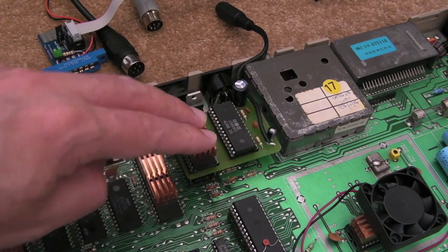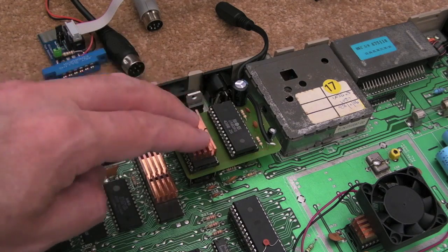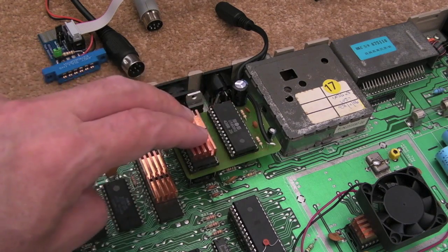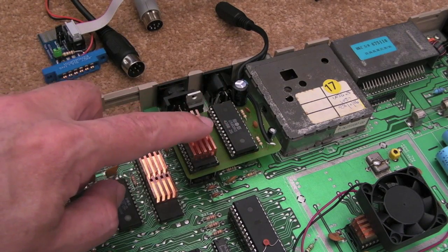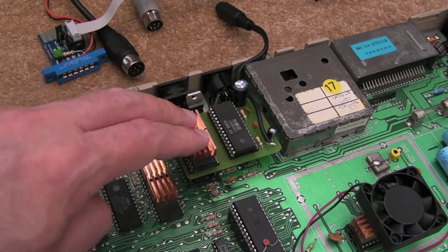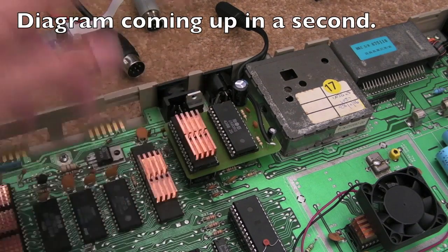Some dual SID boards out there - if you've not got this modification, whenever SID 1 is being read, SID 2 is also being read, and they're both driving the data bus at the same time. One could be pulling it high, one pulling it low, which could potentially kill both SIDs. This solution hopefully sorts that out. I've also removed the two ground contacts on pot X and pot Y on the second SID since it should no longer be read. I'll run the diagnostics card on it and have a go of Last Ninja 3 to see if it skips the intro - but assuming I don't report back, it's all good. Thanks for watching.